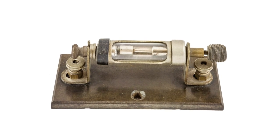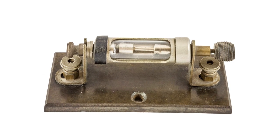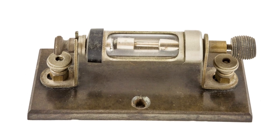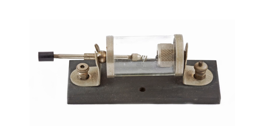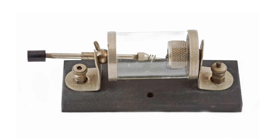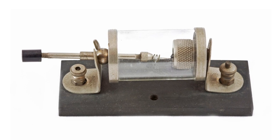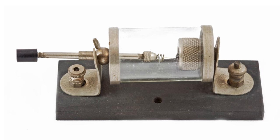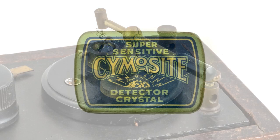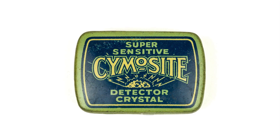The crystal detector was at the heart of the radio. This detector is covered with a transparent tube which prevented dust and dirt getting onto the crystal, which would degrade its performance. In this detector it's possible to see the thin wire that made contact with the crystal — this gave the name 'cat's whisker' to these detectors and hence also to the radios. The detector on the home-built receiver was a little more primitive and did not have a cover, but it's easy to see the cat's whisker wire and the point contact with the crystal itself.